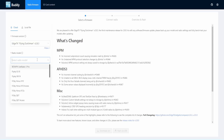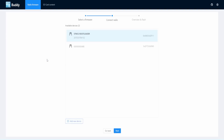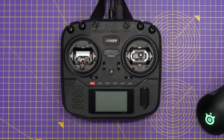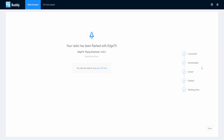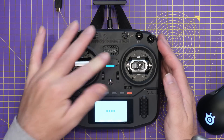We're then going to plug in the USB cable and allow it to connect. You will see the radio flash the lights back and forth until it goes solid. We then head over to the TX Buddy website, select the version we want to install, select our radio which is the Radiomaster Boxer, and click Flash via USB. We're then going to click Add New Device, and what we want to find is the STM32 Bootloader. Click Connect, click Next, click Start Flashing — this will begin the flash process. What it will then do is flash the radio with the latest firmware. The display on the radio will stay blank with just that single LED on, and all you do is wait for the flashing process to complete. Once complete, you will see that it says your radio has been flashed with Edge TX. We can then power the radio back up and we should now be on the latest version.